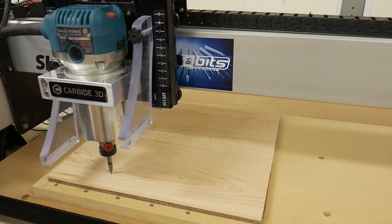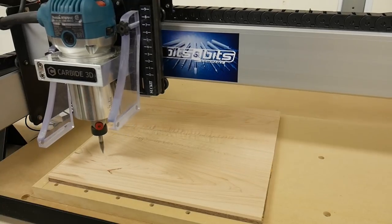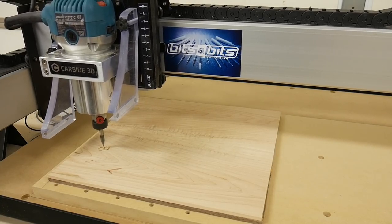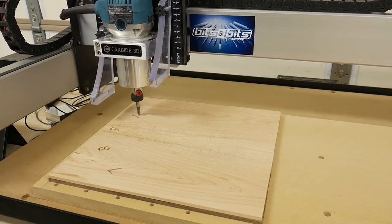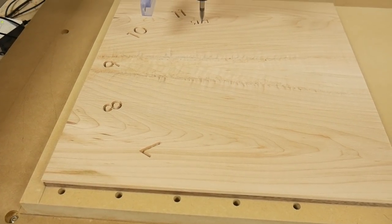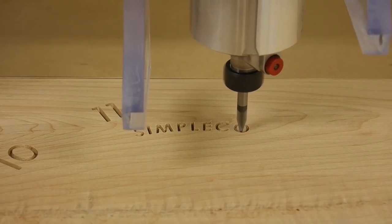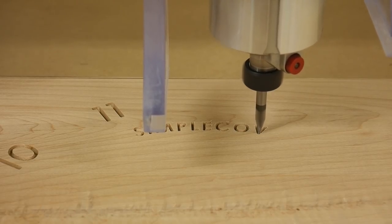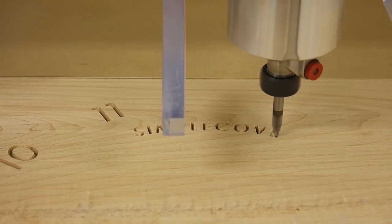This is where the mistakes began. The first mistake was that I forgot to rotate the numbers on the clock design. All the numbers should essentially be vertical on the face of the clock, whereas in my Adobe Illustrator file, I simply forgot to rotate 1 through 11 after adding them using the rotate tool. I was following an online tutorial and the very next step talked about rotating the numbers — I guess I just overlooked it. The second mistake was the toolpath for the logo. For the size of the logo on the clock, I cut it way too deep and it made the smaller portion of the logo kind of hard to read. I've since fixed this by making the logo a separate toolpath and reducing the depth of the cut.